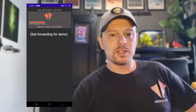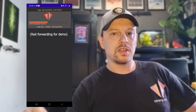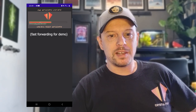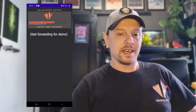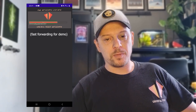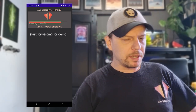Once the file transfer is completely finished, your saber or the CFX board will automatically reboot and you should hear the firmware update vocal — it's quite loud so you won't miss it. If it comes up, it's working, and that's all you need to do to update the firmware. Sometimes you still need to update your SD card, but that is not very often the case.